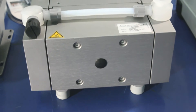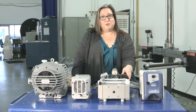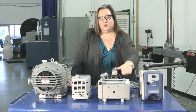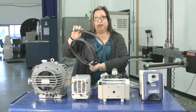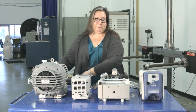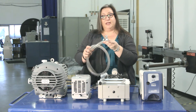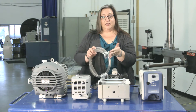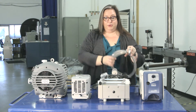This is the Welch 2052. It's a 2.3 CFM pump and works well with either our TVO2 or our TVO5. It's a four-stage diaphragm pump with a KF16 inlet and a standard exhaust fitting with hose clamp. It's very simple to connect: in the connection kit there's a KF16 flange, O-ring, and clamp. Simply undo the clamp, position it, and re-do the clamp. You're ready to go.